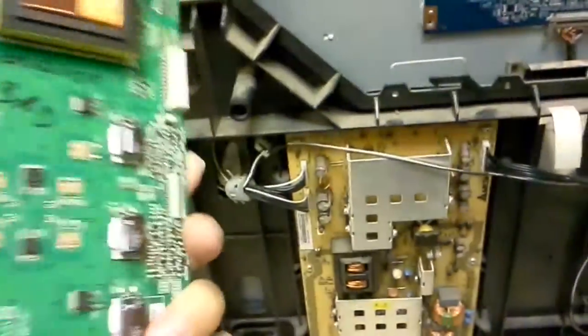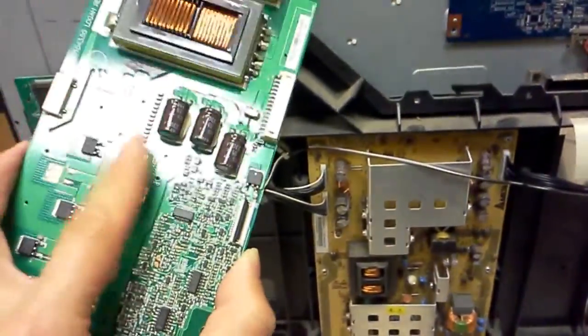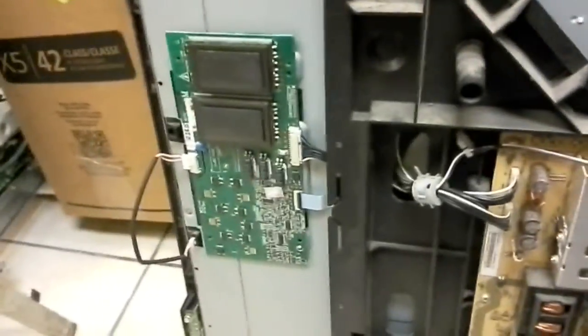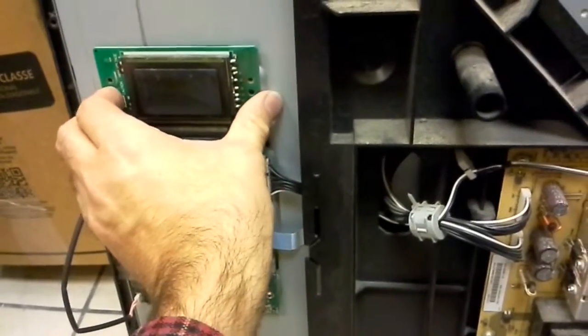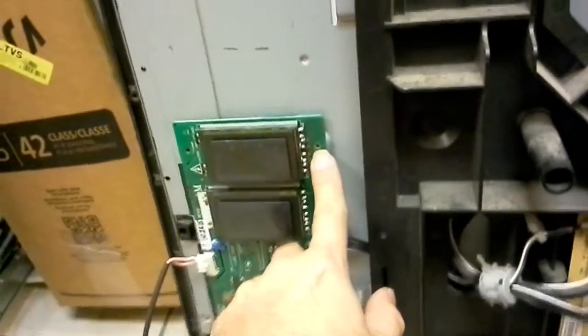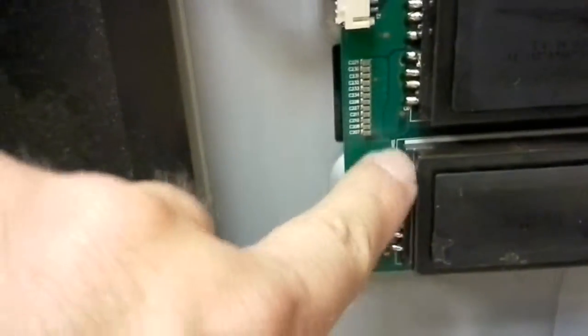Everything that we find is refurbished, whether they advertise it or not, and there are ways to tell when those inverters have been forced to work when they're worn out or repaired. These are brand new ones, or at least for now that's what we're sending. A customer returned them saying they were bad, and they indeed were shorted. It's because when somebody screws through here, there's a copper line running on the back — and the same is on the other side at the bottom — and a metal screw without any insulation going through here can easily make a short and that kills the inverter.